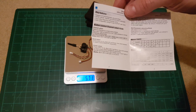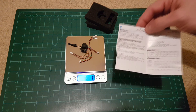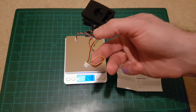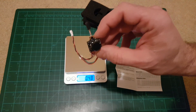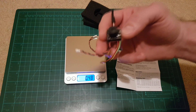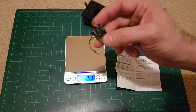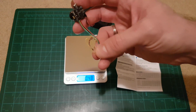What is special about this system? I think it is the first one with a smart audio cable. It means you can use your Betaflight OSD to control everything — power output, band, channel — whatever is available in Betaflight, you can configure it via your controller.